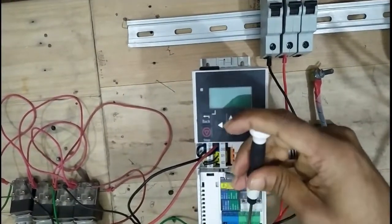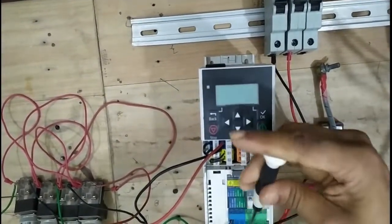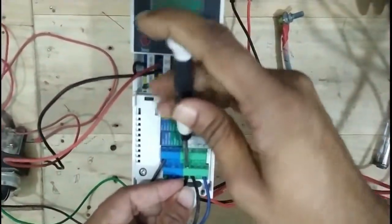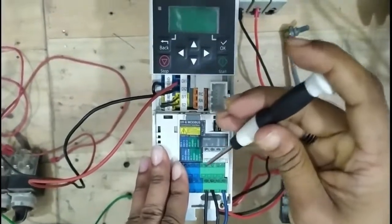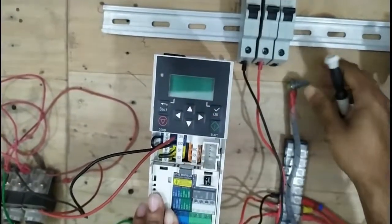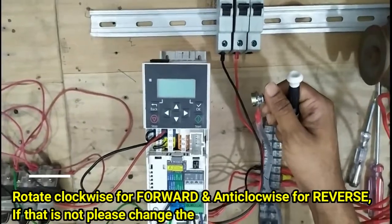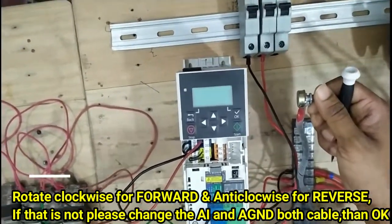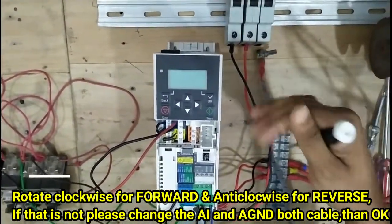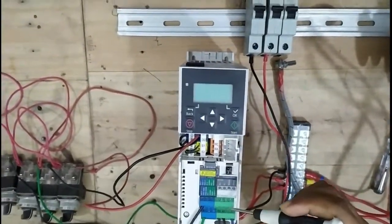You need to clarify which cable goes to AI1 and which cable goes to ground (AG). When supplying and rotating the potentiometer clockwise, our frequency increases — meaning our forward speed increases. If times are decreasing, then AG and AI1 connection may be at fault and correction is needed.